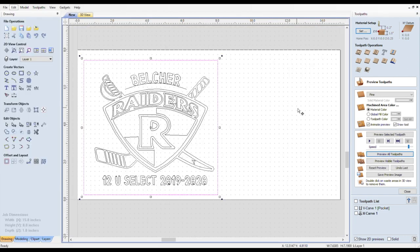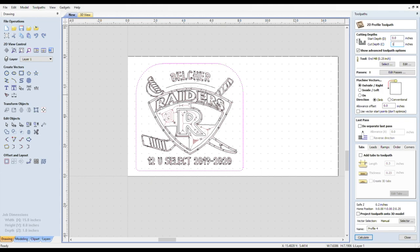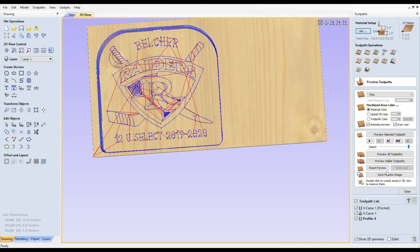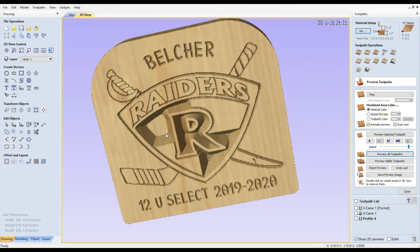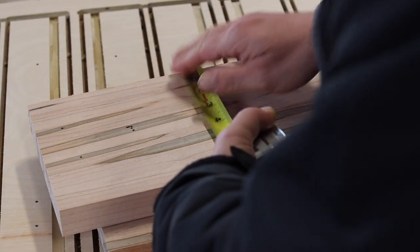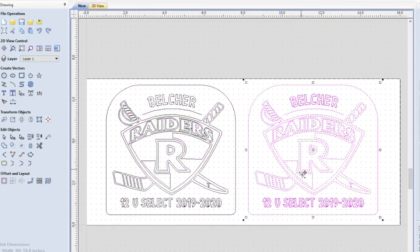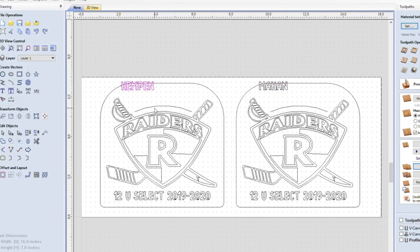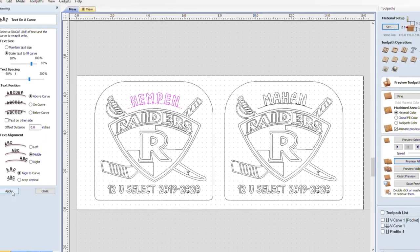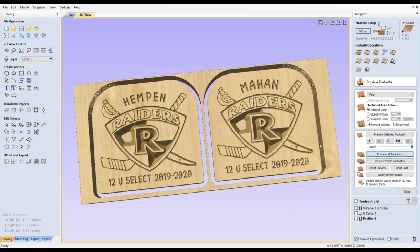At this point I'll add a box around to create a profile and play with the fillets. I believe at the top I ended up with a two-inch fillet and at the bottom a quarter-inch fillet — and we have a plaque. I went out and measured the stock; up to this point I'd actually been guessing. I could take the actual measurements in, adjust the stock, shrink the vectors and duplicate it so that I can get two plaques out of each piece of stock.